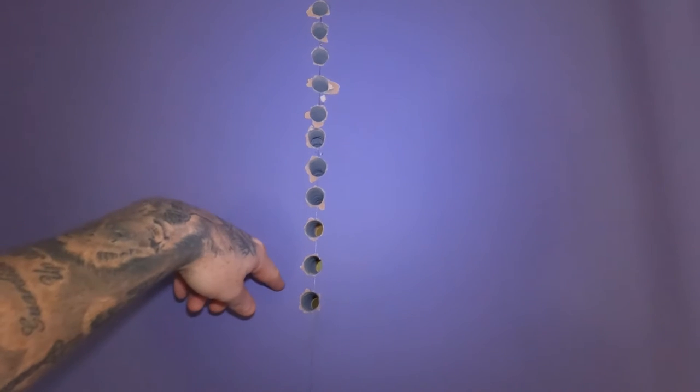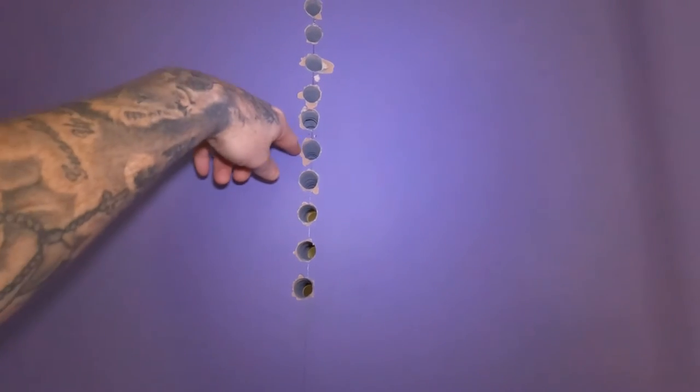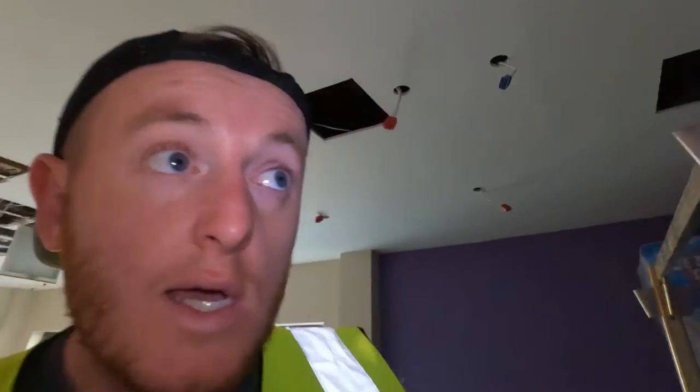Using an SDS drill with a fairly large drill bit, you go right through in stages. Then you drill on the angle upwards and downwards with the drill bit to clear out more of the holes, and then use a chisel bit to clear out the rest, leaving it like that.